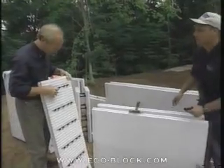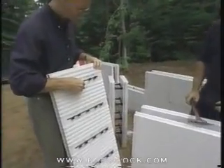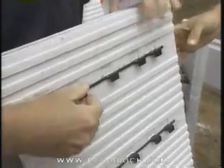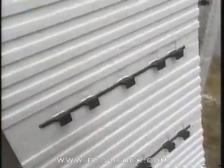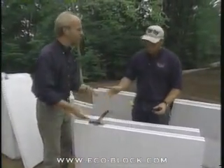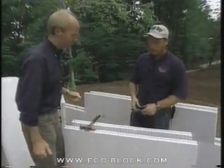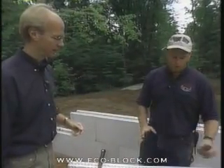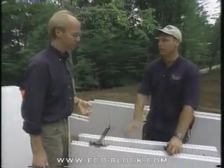Let me just ask a question. These are embedded in the styrofoam, right? Yes, they're embedded in the styrofoam. All they're supposed to be are studs for your sheetrock or any other attachment. You just need enough stiffness to hold these in place until you get the concrete in, which is the real strength. Once the concrete gets in, as long as it holds the concrete for about 15 to 20 minutes so the concrete would flash — this is insulation and studding for your interior and exterior.